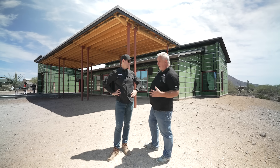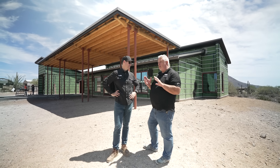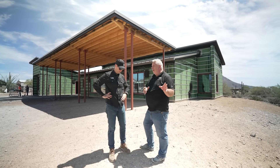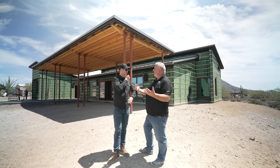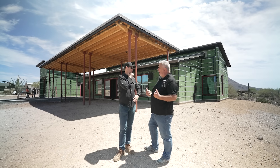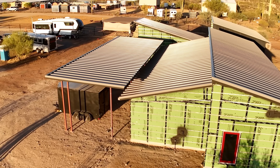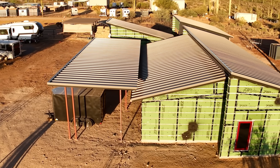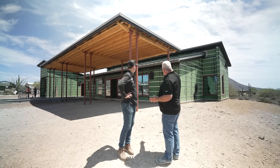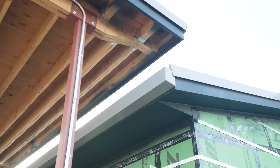I'm going to throw a term at you: positive water management. Usually we're trying to get rid of water, but in this project, because we're only at 11 inches of annual rainfall, I'm trying to capture as much water as possible. That's why this carport is actually carved back towards that roof — it slopes towards the roof — so that singular gutter there captures both the low roof and the carport roof. I didn't even see that box gutter. It kind of goes away because it's extra big.